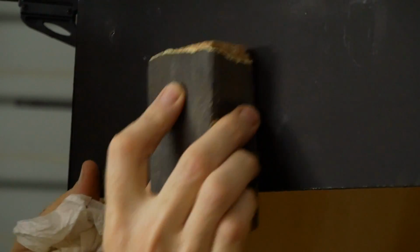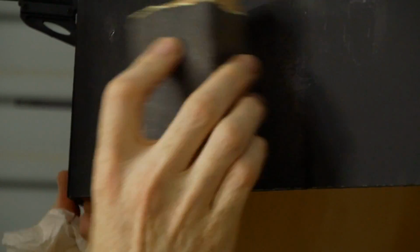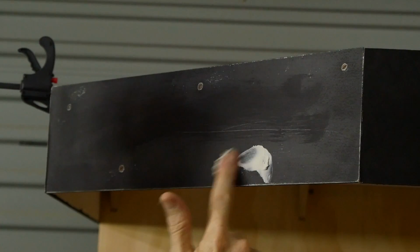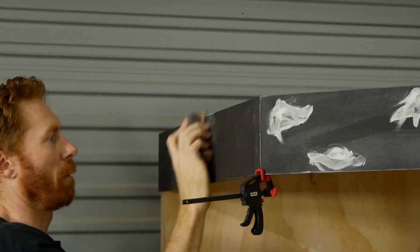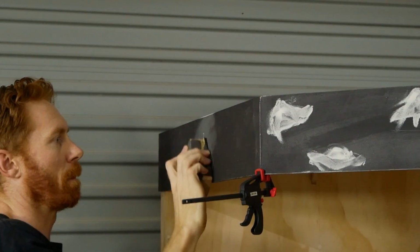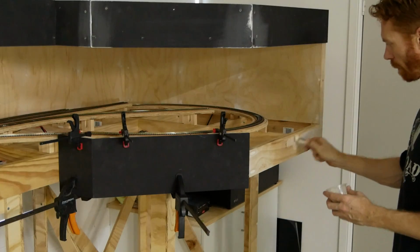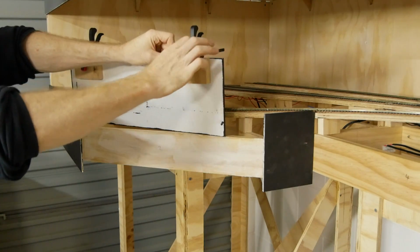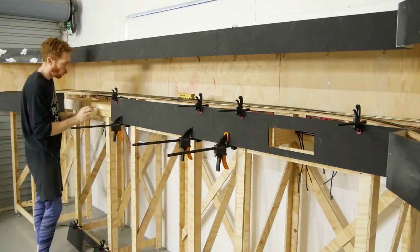With the staples down, I sand the front lightly to remove the raised bump left behind by the staple gun. Then some putty is applied to fill in the small hole where the staple is. Once that's dry, it will be sanded completely flat, and when painted you won't even see that there are staples. These steps are repeated right across the top, and then repeated again across the bottom sections of fascia as well, using those blocks to ensure everything lines up perfectly.